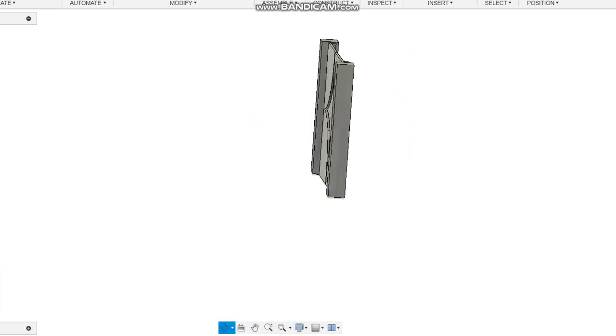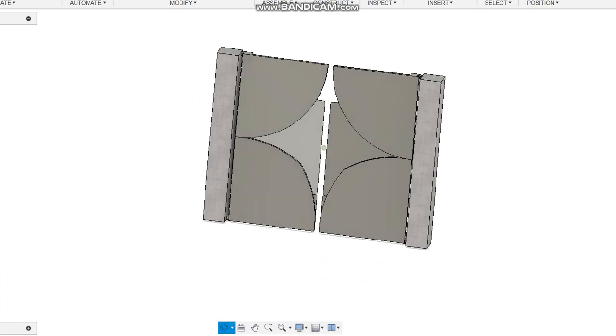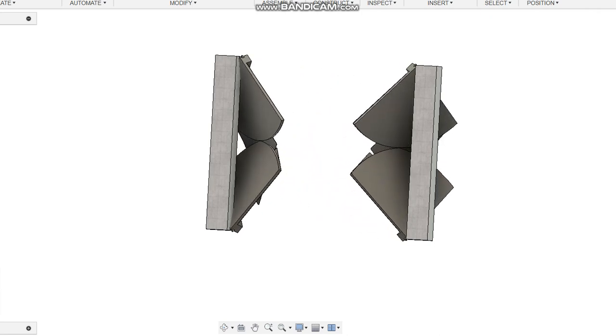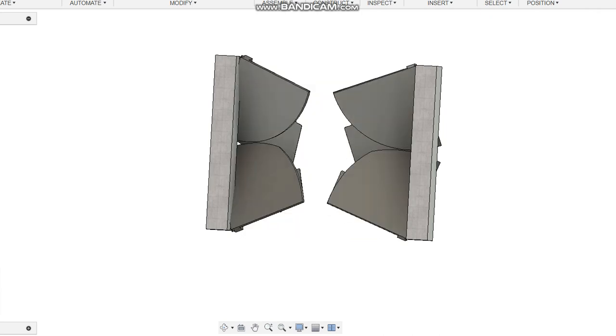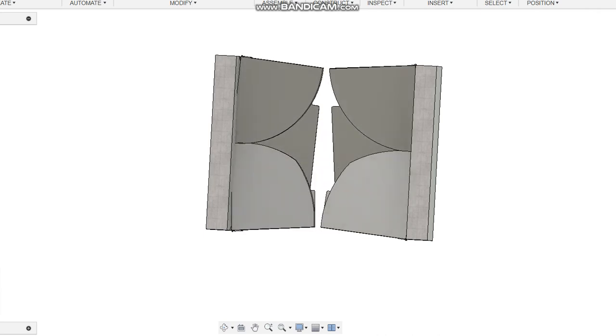The other reason is safety. These gears, and I just really was trying to get the rough idea on paper, but these semicircles have to be gears, and I have a cheap way to make them. But imagine that they're gears for a second. What's neat about this cycle is that all through the cycle, it's balanced. Whenever it's here, and let's say that the motor breaks, now it's just dangling. The weight of this door pushing downward is exactly the same as this door here resisting because it's being pulled downward. And that's the same all the way through the cycle.